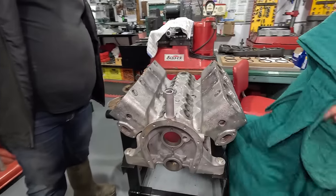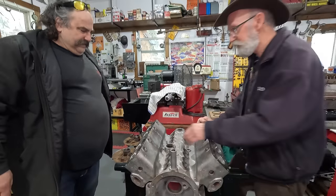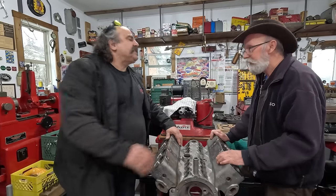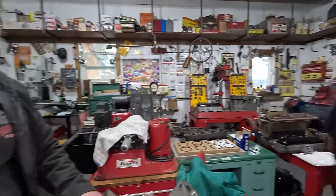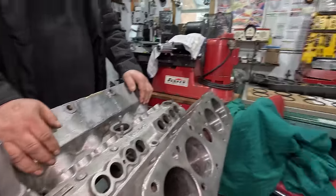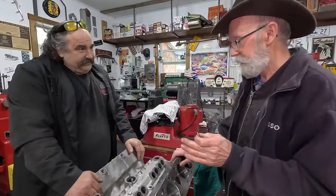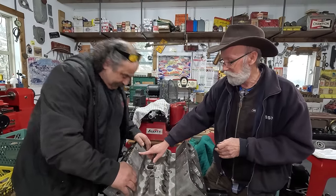So this is the actual block — somebody froze it? Somebody froze it, so I'm stitching it up. You can see the stitching I've been doing here. I'm going to leave these patches somebody put in. Now explain stitching — okay, that's a cold process system. You drill a hole, you tap it, thread it, and then you screw the screws in. Some guys will weld and do it, some guys will braze — you can see somebody's brazed it once before, and somebody welded as well.